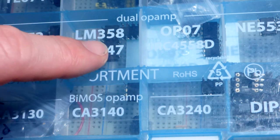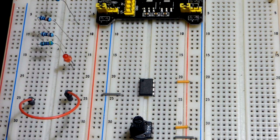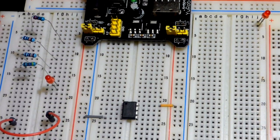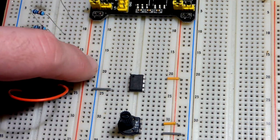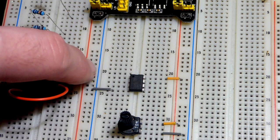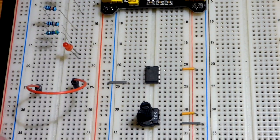In this video we're going to use the LM358 dual op-amp. I like this op-amp for my circuits because I usually use a 5-volt power supply and it works pretty well with a single 5-volt supply. The output can go all the way down to 0 volts at the negative rail, and it can get close to the positive rail—about 3.6 volts—but not all the way.